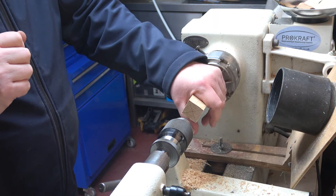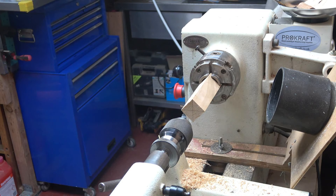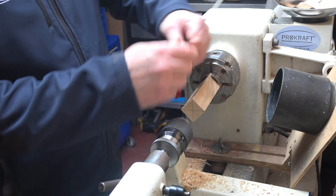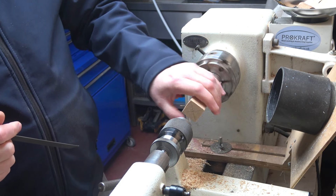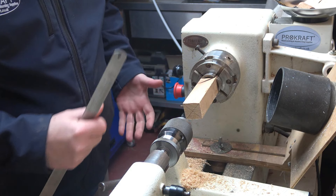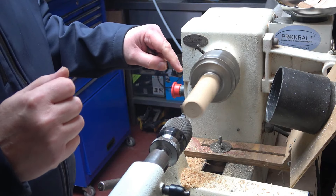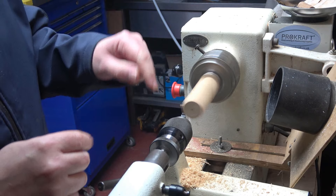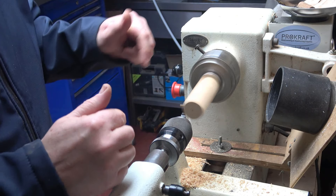I have my blank in here. It's about 125 millimetres long and about 30 millimetres wide — it's about the size of one of our handle blanks, but it's quite big for the serving spoon. Ultimately the size is as you require. I've got my blank; I'm going to do a centre finder, drill four millimetres for the spoon end, turn it round, drill five millimetres for the end cap end, and then we'll turn between centres.